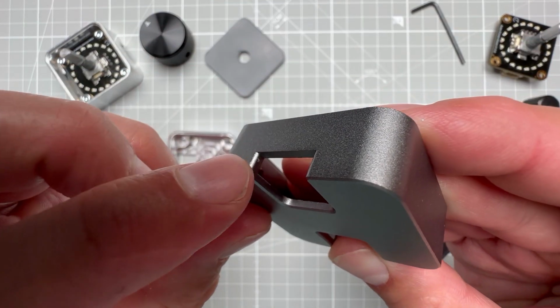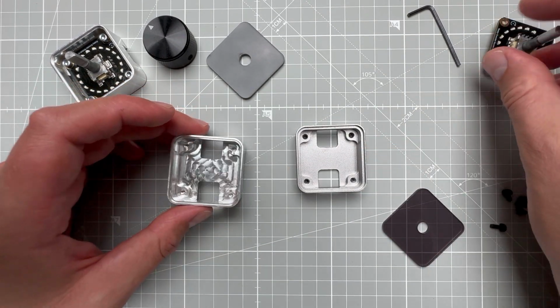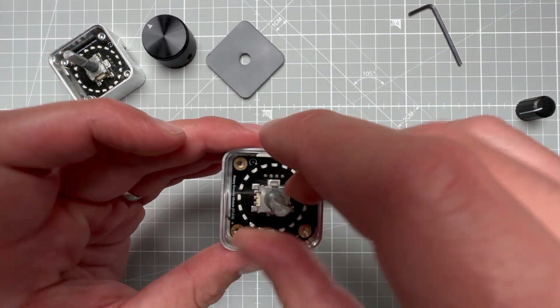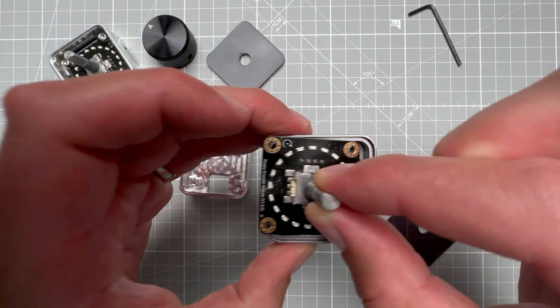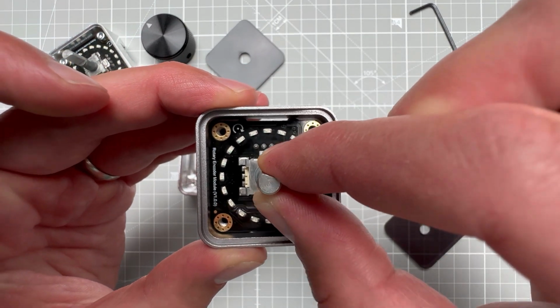The second difference is the distance between the PCB and the enclosure. I've originally started with 1mm on each side and that was probably too big, so I've lowered the distance to only 0.5mm, but I feel like that it could be even slightly less.